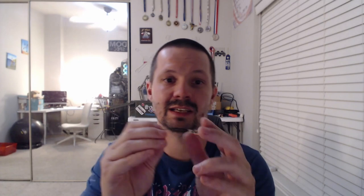The components you choose for your drone affect how easy it is to build and set up, and how well it flies. I like to use the Foxeer 20x20 stack with 60 amp ESC — it's pretty massive, comes conformal coated from the manufacturer, and has a harness so you just plug and go. For video and RC link I use a 20x20 ImmersionRC hybrid board duo with diversity receiver and built-in VTX up to 350mW — only four wires to the flight controller.